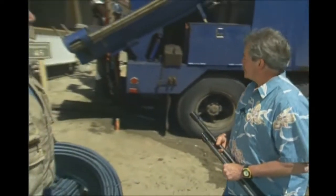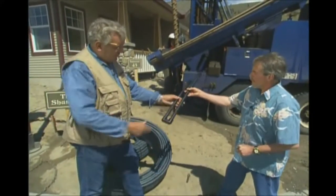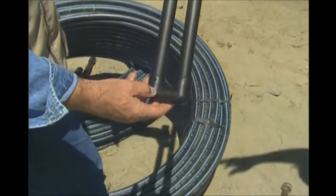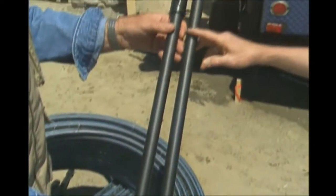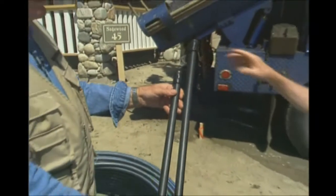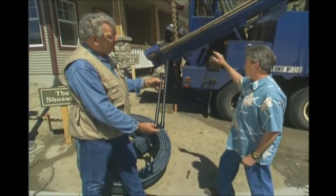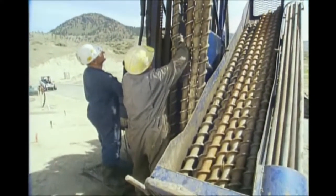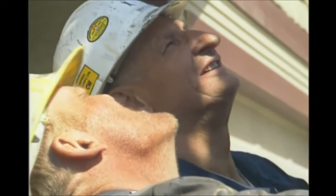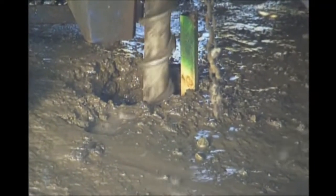To take heat out of the ground, we put polyethylene pipes — like the ones you see here — these are made for vertical bore holes. This drill rig has just punched one hole and we're going to set one of these down in it. We circulate a water and alcohol solution that goes down and back up to a manifold connected to another pipe — in this case two pipes for this home. Two holes, 150 feet each, so down and back that's 300 feet times two — 600 feet of pipe.